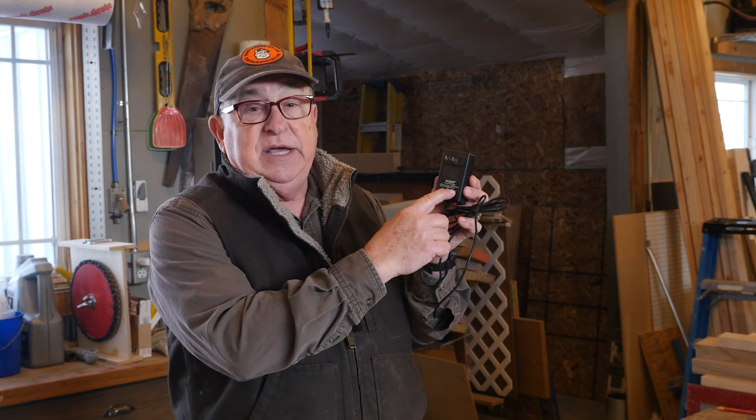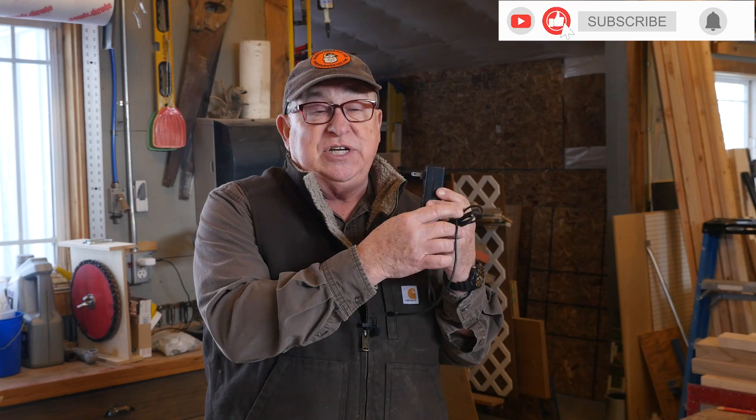Amperage, however, can be different. Think like your house: if you've got a circuit of receptacles all connected to a branch circuit — a 15-amp or 20-amp circuit breaker — you can plug in something that's only using an amp or an amp and a half. Because the device just takes what it needs, not more, not less, and nothing gets burnt out. You don't put larger devices on the branch circuit that will trip the breaker, but you can put smaller ones. Hence, when you're using AC adapters, if I had something here rated at 1.6 amps, and the voltage, polarity, and tip all match the device, and it uses less than 1.6 amps, you're fine. But if it's drawing 2 amps, then this adapter is going to underpower the device and perhaps damage it. So just make sure you have adequate amperage and that the voltages match.